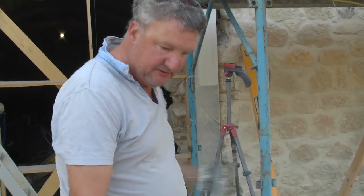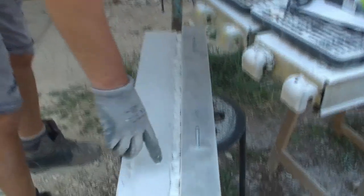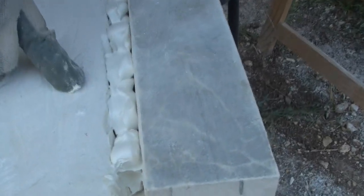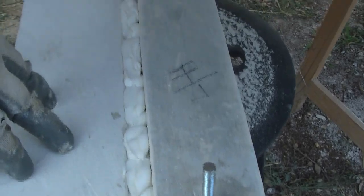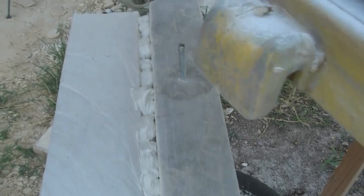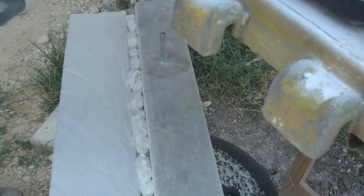We've got two horizontal stones now, one left side and right side. I've loaded it with glue. This is a rubberized glue that just adheres to cement, like bolts itself to it. I need a lot in there to splurge around the girder when the girder sits in, and it will sit just a little. What I don't want really is the girder to sit against the stone. I want the girder to sit in the glue. Does that make sense? Yeah. Okay. All right, so let's get on with it.